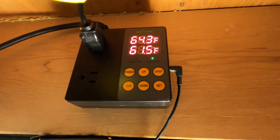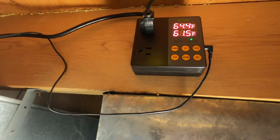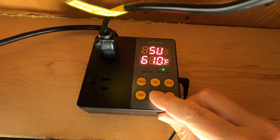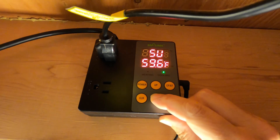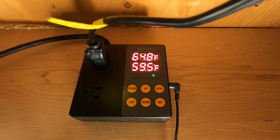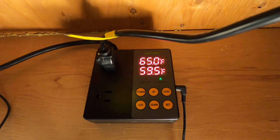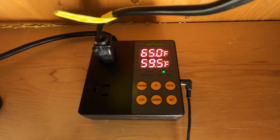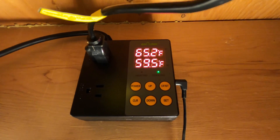I think I can turn the set point down even more — let's try 59.5. The lower I can get the set value, the better it will function. By that I mean: if the temperature drops that far in the basement, the blower will come on whether I need it or not. So the lower I can get that threshold, the more it reduces the chance of false running of the blower. I'm just waiting for the system to cool now.